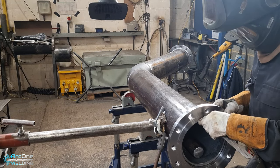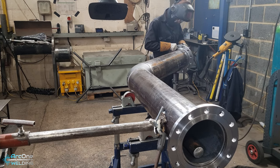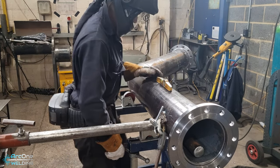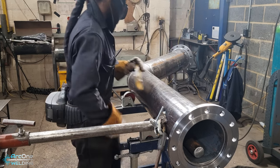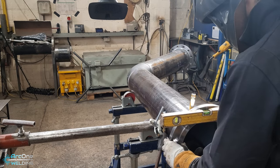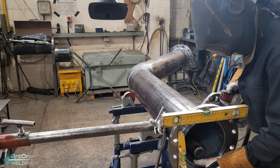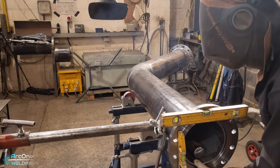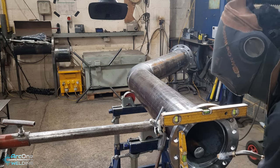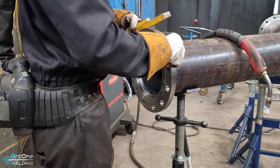I forgot to mention: the cap will be done at 250 to 260 amps — again I control it on the trigger, turning it up or down. That's for the main rolled weld, but for the 45-degree 6G weld I usually turn the power down to around 160 to 180 amps so it's not too powerful and the metal is deposited where I want it and stays there. With the 6G-style weld I do two runs just to make sure the beads are smaller and stay in place, since they don't deposit as much metal, so a second run is needed.